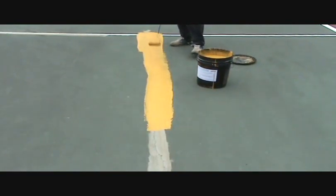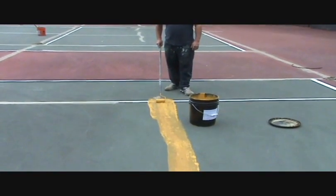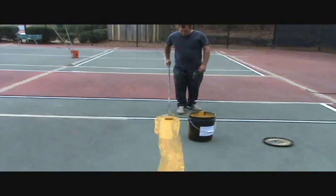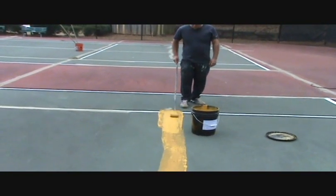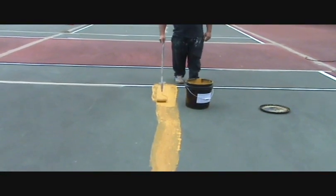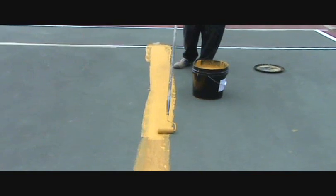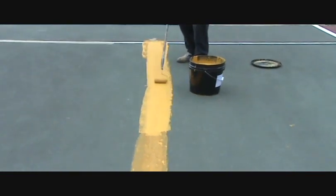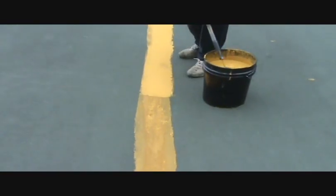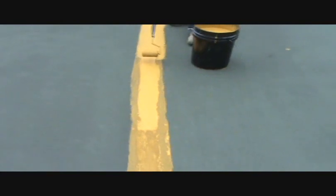Once your first layer of soft coat is dry, apply one more coat over the same area. This soft coat forms a non-adhering layer, which will allow the crack span membrane to stretch and contract as it absorbs the minute amount of movement of the crack over an 8-inch wide area of the membrane. Keep in mind as you apply the soft coat, you cannot put it on too thick, but you can put it on too thin. So apply liberal amounts on both coats.